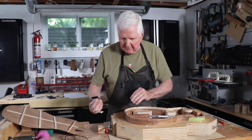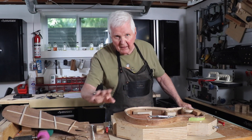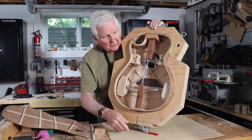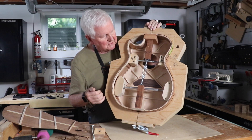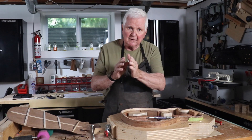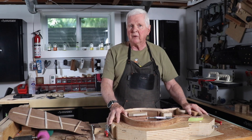So what I did is I made another small jig — a very simple one you can make at home that costs next to nothing. You can see I've got cross braces running across here to keep it tight against the sides. I simply took two pieces of wood and a turnbuckle, took it to the bandsaw, cut a slot, put the turnbuckle into the slot, expanded it, and pushed the sides back where I want them.